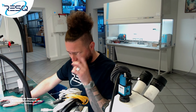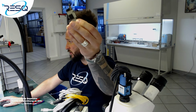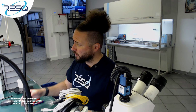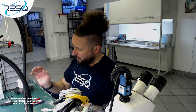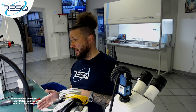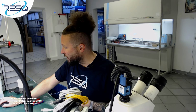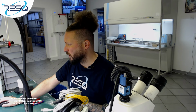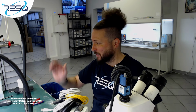So I want to do the following. We now just take off the CPU here, we peel off the logic EEPROM, we peel off the NAND flash storage, we rework that, then we have a look if the phone is already done with grabbing data. If not, we just do a shortcut and we will go on after data out of this device are saved. We are at 20% now. It tells us about 1 hour, so perhaps we are a little faster. We just directly go on.